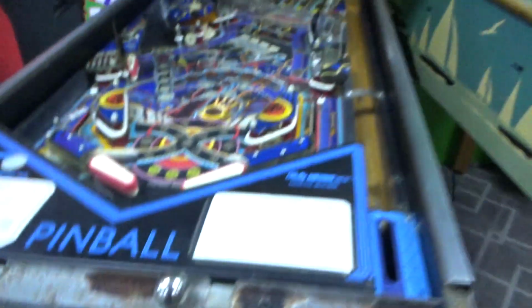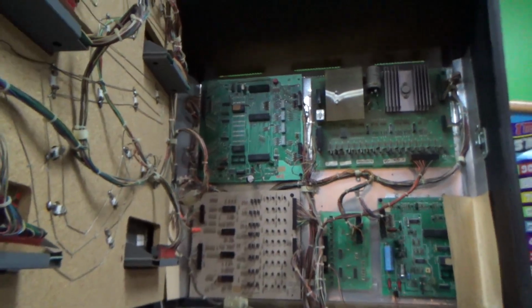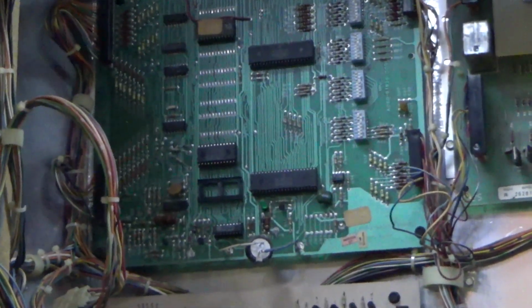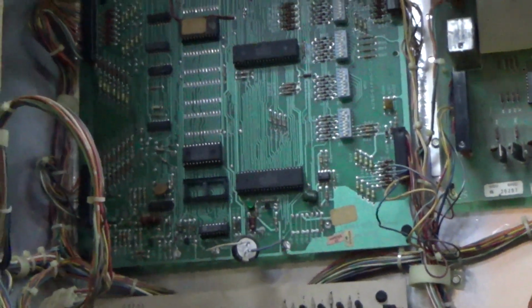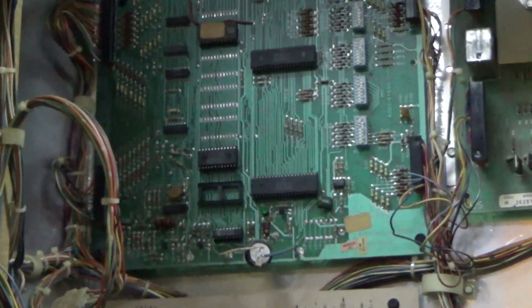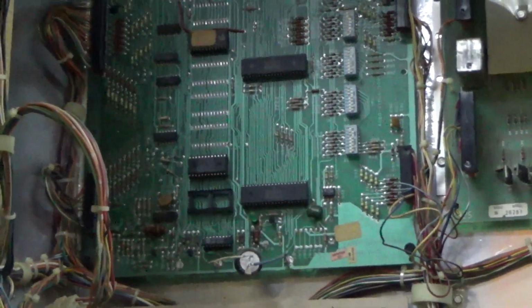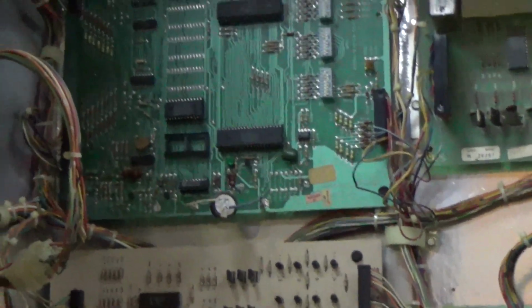Okay, I think we're good. He said it was doing it like immediately. All right, now this MPU, if it works like the 6800, there's a light down there at the bottom, and I just saw it flashing out of the corner of my eye, so that will flash really quick, like a blink. And then it will flash 7 more times. That's like the boot up sequence. So we'll watch that.